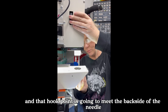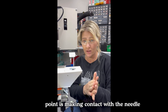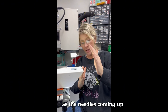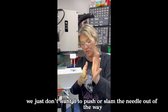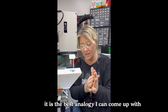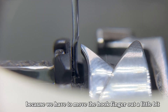As the needle is coming back up and the hook point is going to meet the back side of the needle, we need to talk about something called deflection — basically how hard the hook point is making contact with the needle as it's coming up. We want the hook point to just lightly kiss the needle as it comes around, just lightly graze the back side. We want it to make contact; we just don't want it to push or slam the needle out of the way. A very light kiss is the best analogy.